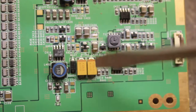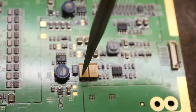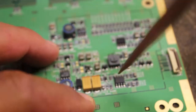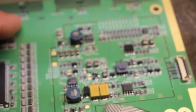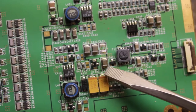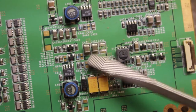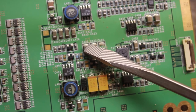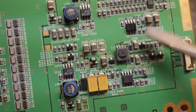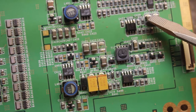And there's some nice tantalum capacitors there. Usually what I'll do is take off my tantalums and then take off these monolithic ceramic capacitors — the ones with the C's. Not the L's or the CA's or anything like that, just straight C and then a number.